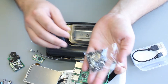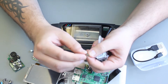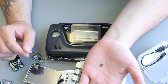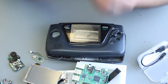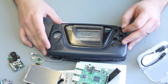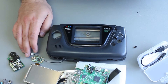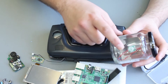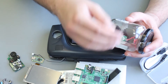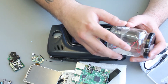I've got a bag of these double-leg micro switches — a tiny little switch with two legs and a nice clicky feel. We're going to mount that behind all of the controls on the Game Gear face. I've also ordered some capacitive touch sensors. I've been testing one — the idea was to test something that worked through glass, plastic, or basically any non-conductive material. The way this switch works is it emanates a field, and when it detects the capacitive nature of your skin, it triggers. You don't even actually have to touch it — just be near it.